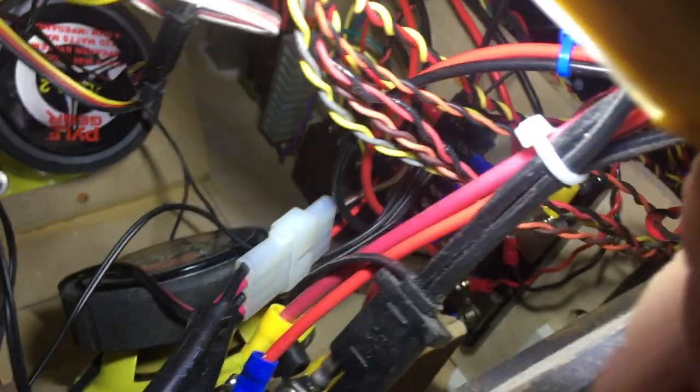The main controller is an Arduino Mega ADK with a Bluetooth adapter. I designed a shield to mount the soundboard and the servo board directly to it to save space. There's also miscellaneous voltage regulation, an audio amplifier in the back, a standard Sabertooth down in the corner feeding the motors, and a custom sound box I built for the audio which ports out the bottom.